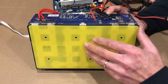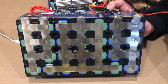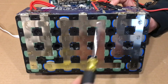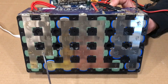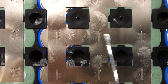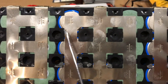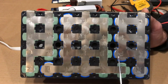I'm going to pull the covers off to show you the arrangement of the batteries. Here's how they link all the batteries together. You can see the batteries have different colors showing through — this is a negative terminal on the battery, and this is a positive terminal. The batteries are flipped back and forth for this pack design to get the proper voltage that this inverter requires. This is how the batteries are joined together — cylindrical cells joined with bus bars. I don't know if it's stainless or what material the bus bars are made of, but they do little spot welds at each battery cell to join everything together. You can see the green sides and the blue sides of the pack and how the arrangement is built — negative side, positive side.